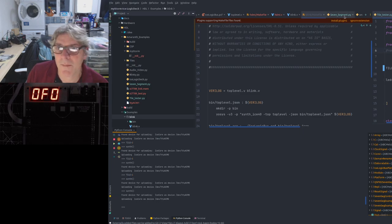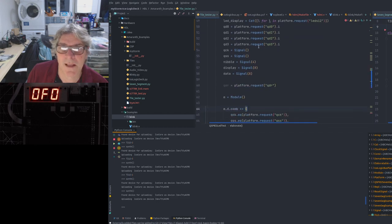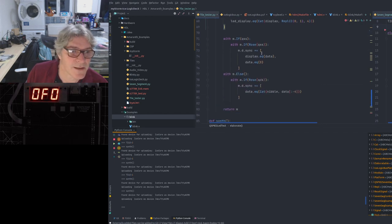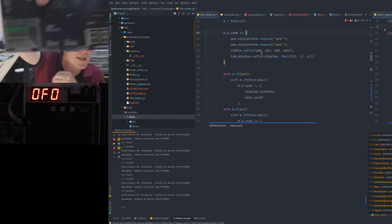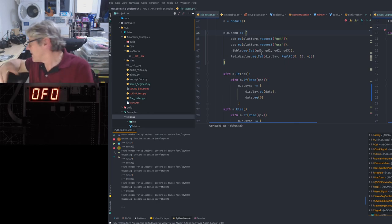The other thing I was working on, remember before we were working on the tile tester, and what we were doing is we were programming the FPGA and then activating the QSPI and then counting up on the LEDs. Well, unfortunately, that version is the old version of the tiles with the LEDs on. So that is upside down. So I've converted that over now.